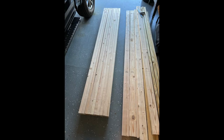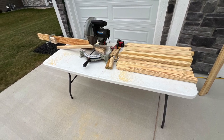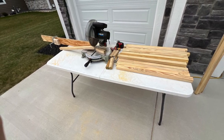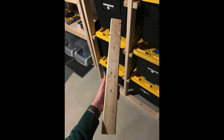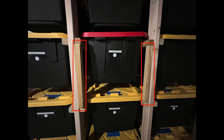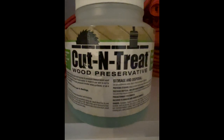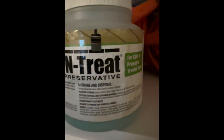First I bought the wood, then I cut it to size. I made a janky stop block for my chop saw so that my cuts were consistent and repeatable. Here is the 21 inch spacer to separate the studs and the 15.5 inch spacers for the bin rails.